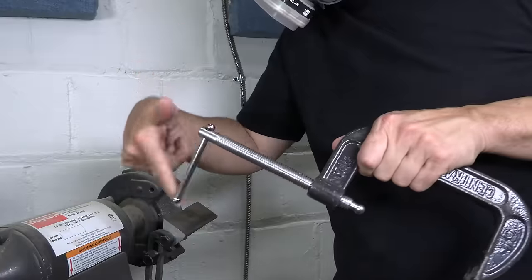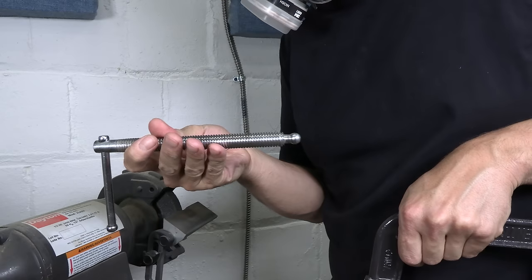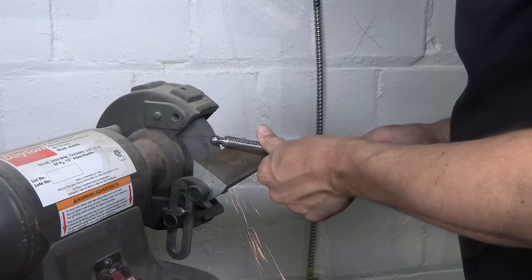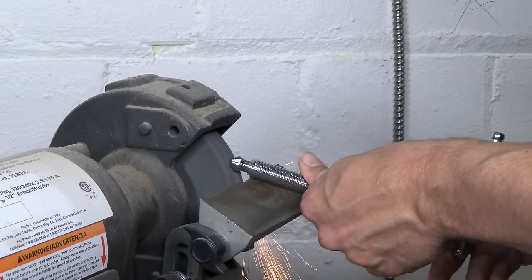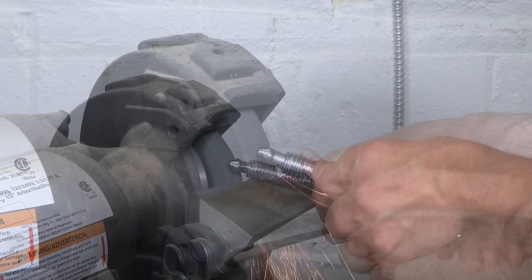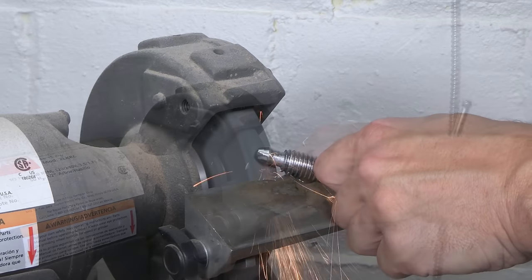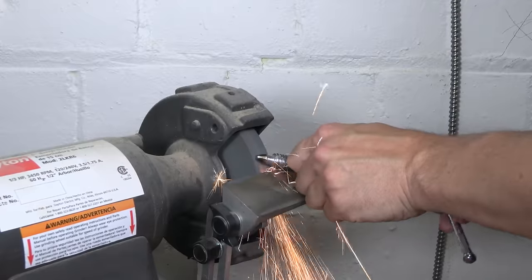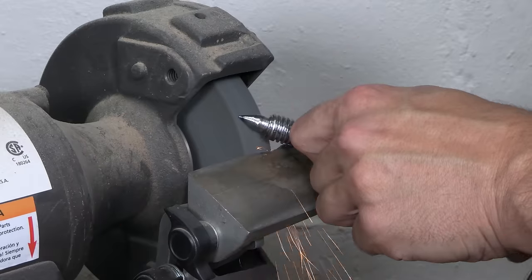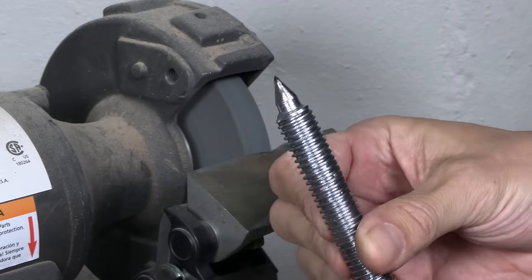I used the screw from a Harbor Freight C-clamp. The clamping pad popped right off, and then I just unscrewed it. It's a solid chunk of steel with thick chrome plating, a square thread, and a nice handle. All it needs is a point on the end, and that was pretty easy to make just using the bench grinder. You can also do this with an inexpensive belt sander, as long as you clamp it down to something solid. To get my point, I'm just rotating that ball end against the wheel. This steel is surprisingly hard and it takes a while to grind away enough material, so you have lots of time to check your angle and make adjustments. I just went for a smooth cone shape — I didn't measure anything. Once I had my point, I continued that taper up into the threaded section. Tapering those first few threads will make this much easier to screw into the wood.